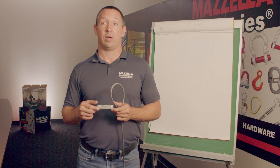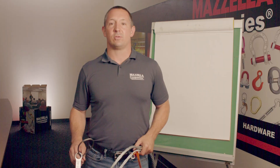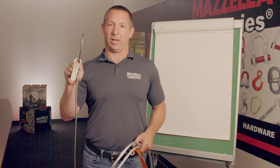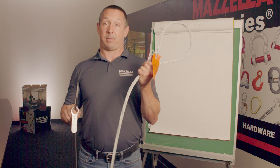You may also see the vertical choke and basket hitch capacities on the tag. Not all sling tags will have these, but these will be excellent items to have for your people out in the field. So far in covering the basic construction of a wire rope sling, we've mostly been talking about a single part sling. But also what you might find out there, there are multi-part slings.